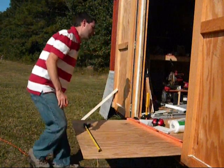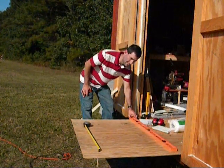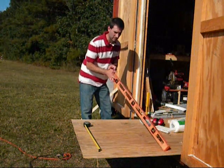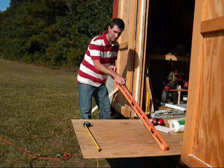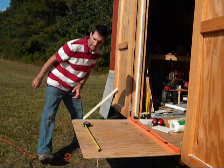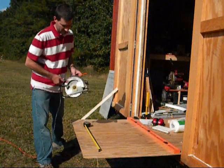Here's my 27 inches. I want to use a guide so I have a nice clean straight line, and I'm going to use this 4-foot level that I've had — it's true and straight, so that's why I'm using it. And on the saw here, I'm using a power saw, a skill saw.